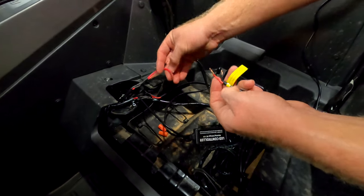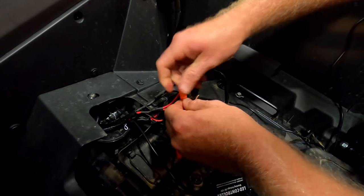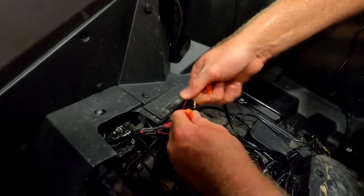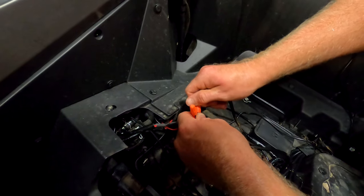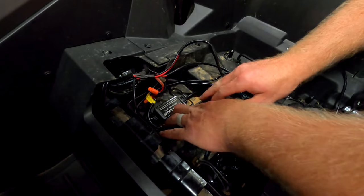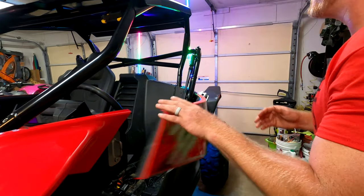You're going to go red to positive, and you can use a wire nut, a splice connector, whatever you choose. For simplicity I'm going to use a wire nut for right now. For your negative, you can wire it to a negative wire or run it to the frame of the machine. I'm going to use wire nuts for now — you could tape that up really good, or use a butt splice connector. Secure this, tidy your wires, and route it through the machine. Make sure your wires are not going to be on anything that will cut them. Now I can simply flip on the power of that switch and my whip lights are powered.